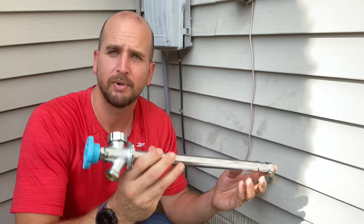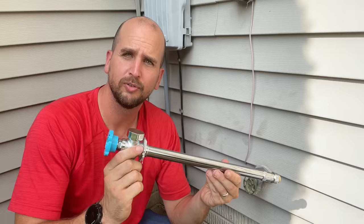There will be no soldering. We won't be using any pressed copper fittings that need specialty tools, or any PEX requiring a crimping tool either. What we're going to use is the DIYer's friend — SharkBite. This is the SharkBite frost-proof outdoor spigot with a 12-inch offset, which will match the one I'm replacing. Remember to look at the hardware you have, measure it out, and if it's been working successfully for years with the valve properly placed inside your home, just replace it with the same type.